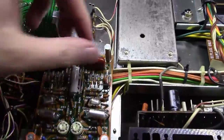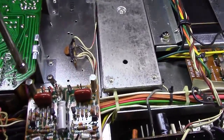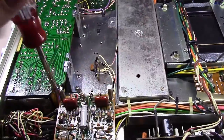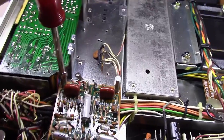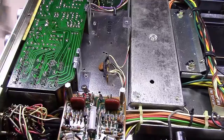One thing to note that's different about the P400 board than the P700 is kind of the mounting. If you'll notice here, especially in this 2265, it's got these studs that mount it and these end up actually being support for the bottom of the amplifier. It's a quarter inch nut driver that I'm using here, just standard Sears issue kind of stuff, and these things will screw out.